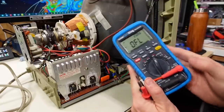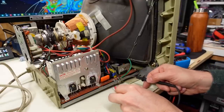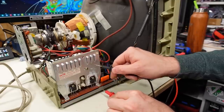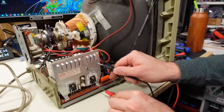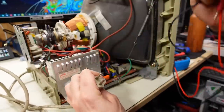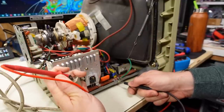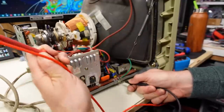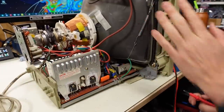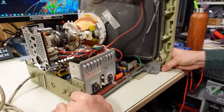I can demonstrate that with the multimeter set for continuity. The CRT is grounded to the chassis down here, but on the chassis we are not grounded to the heatsink. Taking the missing prong from the plug - the earth ground on the mains plug goes to the chassis and to the CRT. So do not touch that heatsink while this set is operating unless you're using an isolation transformer.